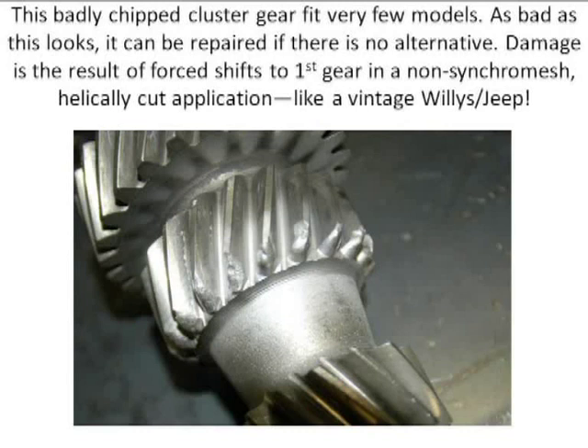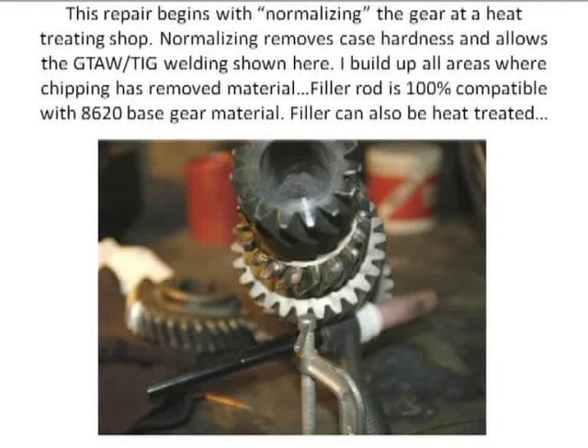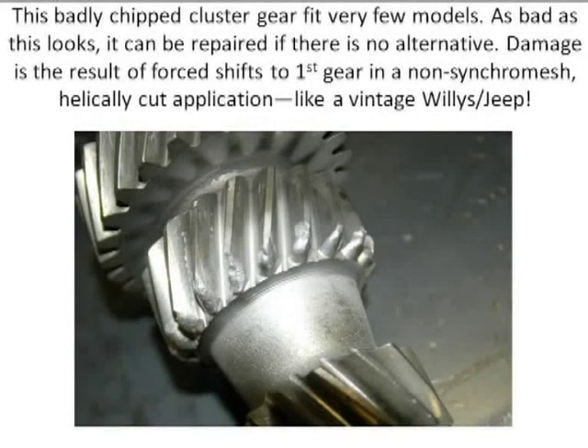So I'm left with an alternative. Can this gear be fixed with the damage I just showed you? First of all, you're working with a gear that's probably 8620 material — it's case-hardened. That's a carburizing case process that hardens the surface of the metal after machining to a depth of 30 to 40 thousandths of an inch, depending on the specifications. It brings up the Rockwell hardness of the teeth on their surface so they're hard and hold up. When you go back to that break — these chips are through the case hardening. You've not only lost the engagement point on the tooth, you've lost the case hardening of that whole section.